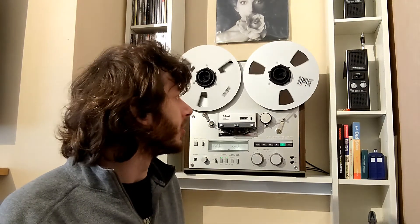Here we are with it all running after successfully replacing 62 capacitors. I thought it was going to be 72, but if I'd paid more attention to the schematic I'd have realized I didn't need to double up on all of them. If you decide to do this yourself, I highly recommend it — it's made a big difference. It probably took me about five or six hours, but well worth it. Take your time, be methodical, make sure you get everything in the right way around. Unfortunately my phone camera died towards the end, so you haven't got all the footage. Keep an eye out for my next video where I attempt to calibrate this thing — something I've never done before, so that'll be a learning experience too.